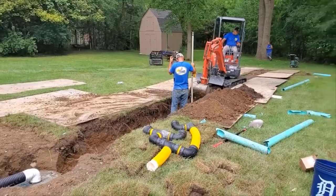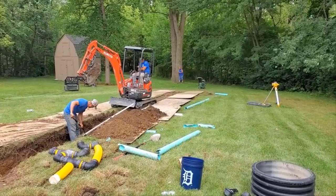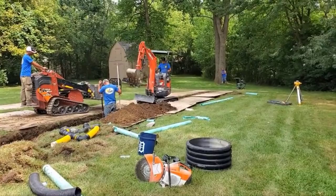Okay, back in Rochester Hills, Michigan, they're digging out the leach field right now. You can see the manifold laying on the ground. All those fittings put together, that's for a five-finger leach field that's going to be made out of knife cut. The Boffman knife cut, heavy-duty sidewall, no material ground out, just a blade makes a cut. It's great for leach pipe for yard drainage. I highly recommend it. It's all we use.